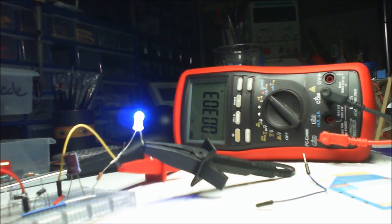but I suppose it has got a reduction on cost if you thought about it like that, because for that DC smoothing capacitor, you don't need a high voltage, unlike on some of the other ones, like in the little LED light kits that I bought from China. That's what made me start looking at these transformerless power supplies, because the kits I got from China just startled me as to whether they were going to be safe or not. And really, I suppose they are, as long as they're enclosed.